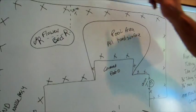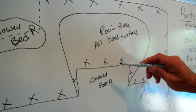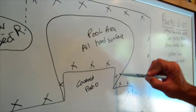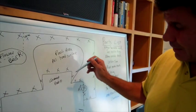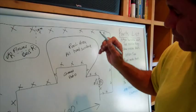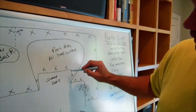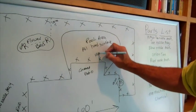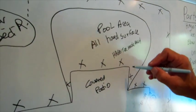We finished that run and the risers. Now going this direction, you've got T nozzle assembly, T nozzle assembly. Here's your covered patio sitting area, and you've got a pool area with hard surface and decorative stone or pool deck. In this case, we like to put what are called Hago T nozzle assemblies here, because they have stiffer springs and will not allow the pressure to bleed off. The smaller nozzles, when the system shuts off, give a little bit of afterspray — minor dripping — and over time that minuscule dripping could cause staining over decorative light-colored stone or pool deck. So we install Hago T nozzle assemblies here — you're going to have five of those.